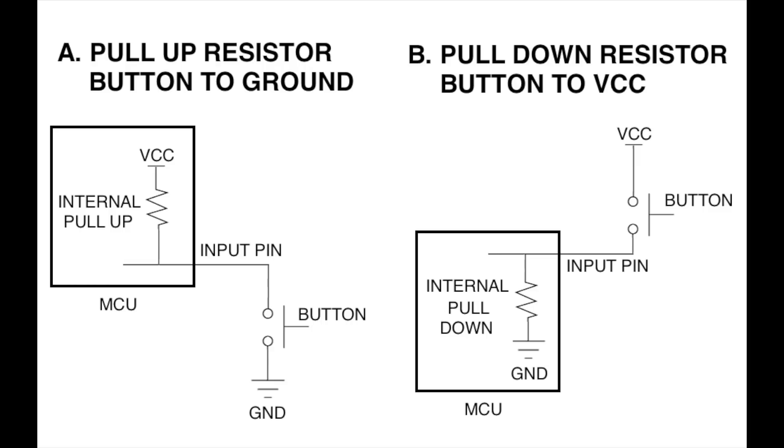When you're breadboarding something up yourself, you can use an external resistor. The nice thing is you can pick the value — sometimes you want a slightly smaller resistor, like a 1k instead of a 10k or 50k, which makes it a little more rock solid. But that also means when you press the button, you're burning a little more current through the resistor between plus and minus. You're in control of the trade-offs with an external resistor. Understanding this will also help make sense of biasing resistors for transistors in more complicated circuits.